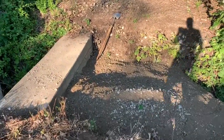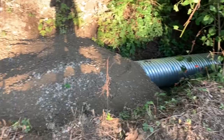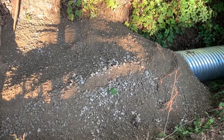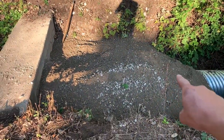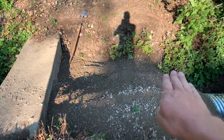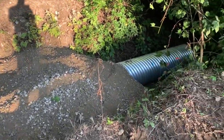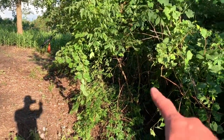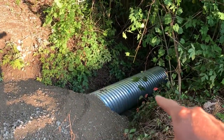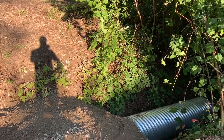I've used up most of the material now. The culvert is placed on a pretty good downhill tilt so it's draining well, and we've packed the crushed concrete in around the culvert so it shouldn't have any crushing problems. The width of the crossing from about here to the edge — which will get covered with topsoil — is about 10 to 12 feet, so I've got a nice wide crossing. If I ever want to make it wider, I'd trim these trees out and get another load of material. This is a 20-foot culvert, so I could have an 18-foot wide crossing here if I ever wanted it.